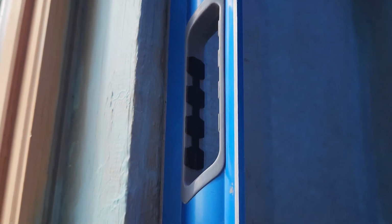I did notice that my top was nice and plumb. And the only other area, if the camera can pick that up, which it probably can't, is just a little bit right in that area right there too, for a couple inches, but barely, even less than a 1/8 inch gap like we have right through there. So just keep that in mind, take mental note, and you're just gonna have to add a little bit more thin set in that general area to take out that gap.